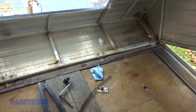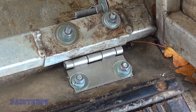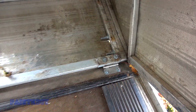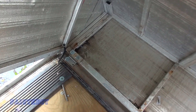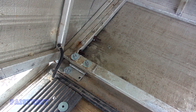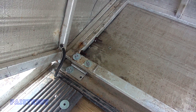All right let's take a look at what we've done here today. We replaced the hinge down here — brand new aluminum hinge but galvanized bolts. They weren't as strong as I thought they'd be, because we got the second one in and I noticed it was cracked pretty badly and one actually broke. So we've got to go for a third trip to Home Depot for hardware, and then we'll finish up with that piece of wood.